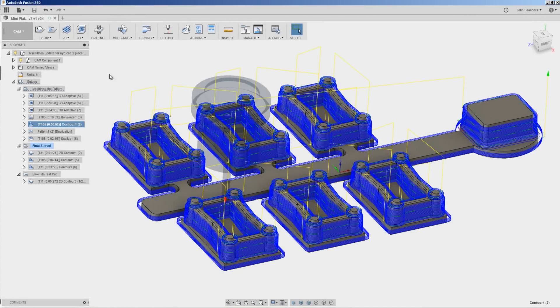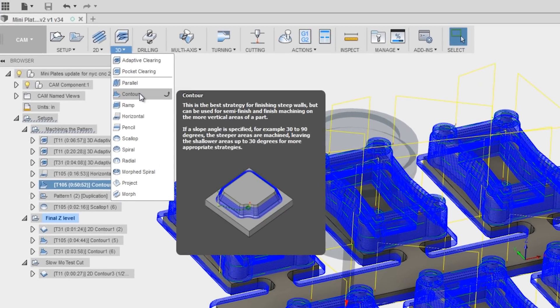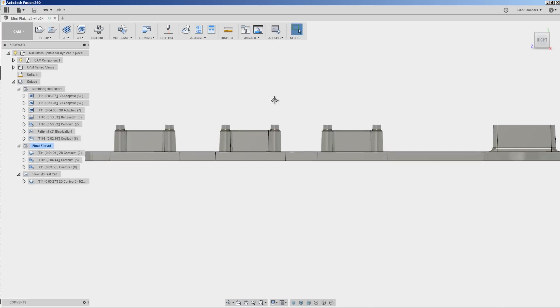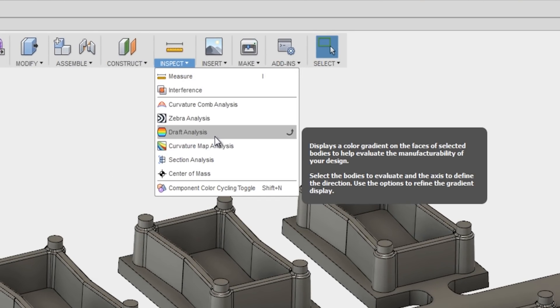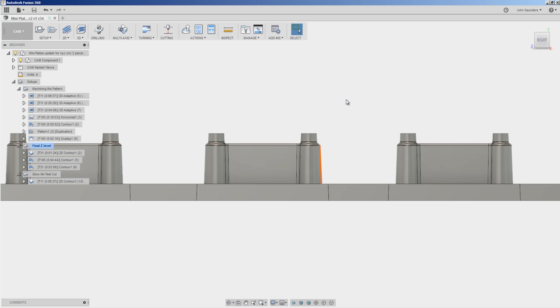Now, this is important. We are using a 3D contour — the best strategy for finishing steep walls. This part has what's called draft angle, so none of these surfaces are square; they all hold a little bit of taper. Fusion has some pretty cool basic analysis tools under Inspect Draft Analysis which can help you understand the quality of that angle. Basically, it needs that draft angle so that after we pour the sand around this casting pattern to make our mold, we can then lift the wrench-shaped piece out. Without a draft angle, it either wouldn't lift out or you would end up damaging the shape of our sand casting mold.